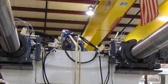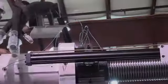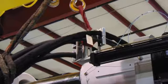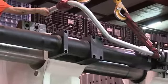Mount tonnage manifold on top of pancake platen. It is important to note that mounting bolts are with the manifold. This unit will have hydraulic and electrical connections. Mount tonnage hose bracket with hoses to top of the pancake platen. This unit will have hydraulic connections. Mount steel tubing from both non-operator and operator traverse cylinders to the traverse manifold.